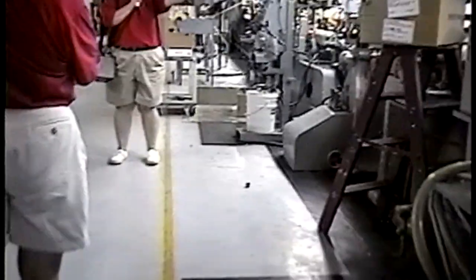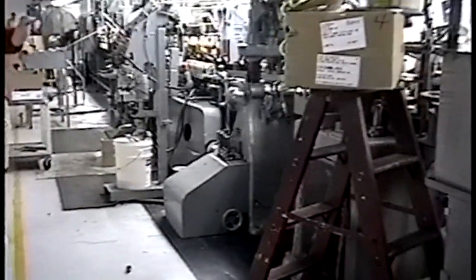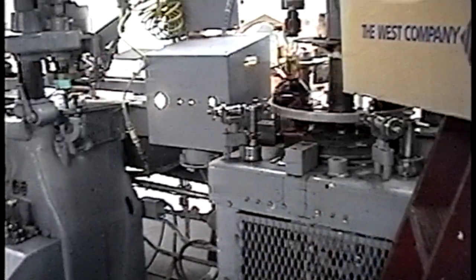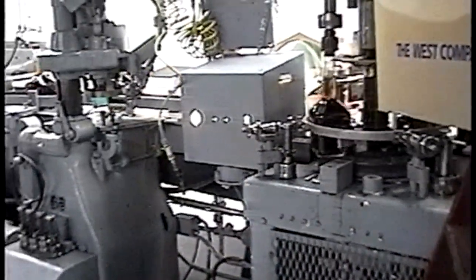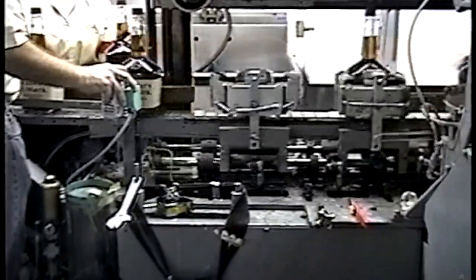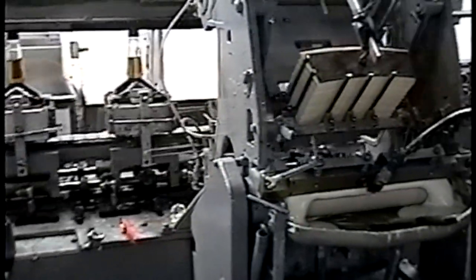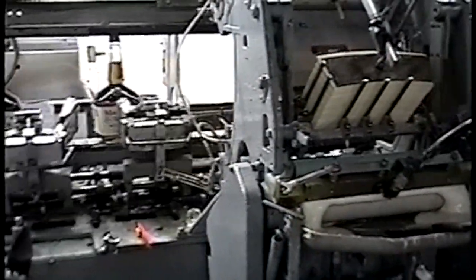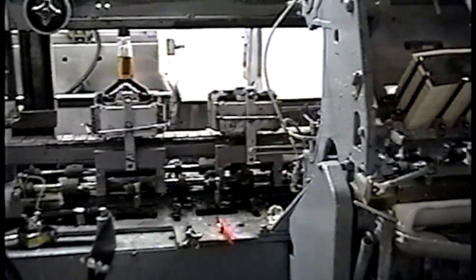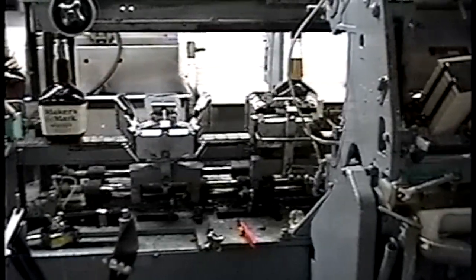it's going to come and get a cap. It's a plastic screw cap that we use after the product is filled. The labels are sitting in the plate above. The plate glues on the bottom, a blue roller picks up the glue, a clean plate comes up, gets the label, glue goes on the back of it, and then it's pulled up and put on the bottle. And then as you walk past, you're going to see 2 arms coming in and tugging the bottle. They are fitting the label to the bottle.